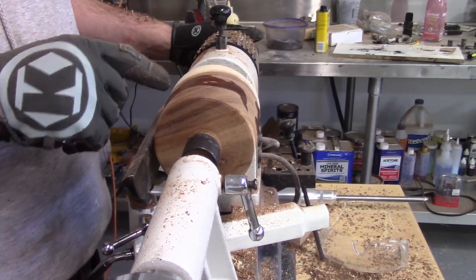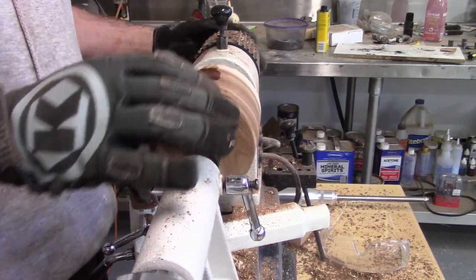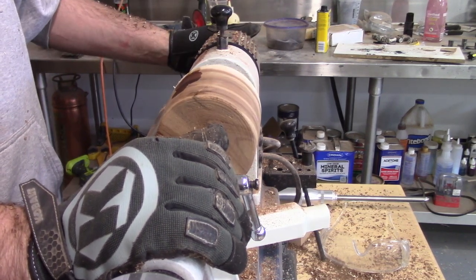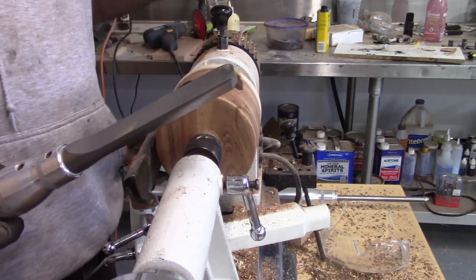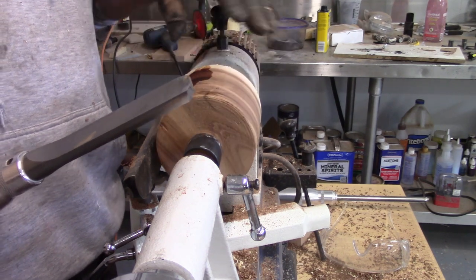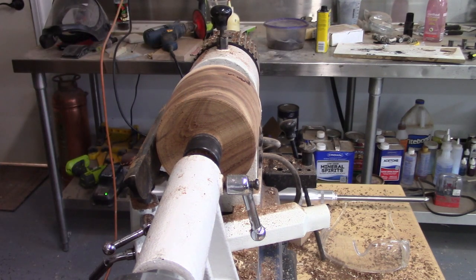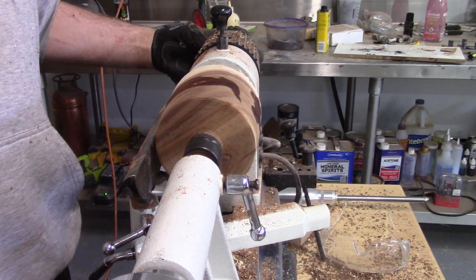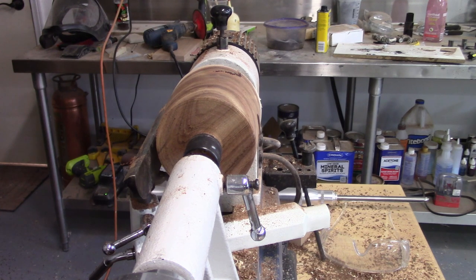I added a little bit of CA glue there just because I see some cracks in the wood, and I want to make sure they don't continue and it holds together. I'll probably have to do a little bit of filler. On the mesquite I've been using coffee grounds – old coffee grounds that I dry out. It blends and fills pretty nice, it looks like it's part of the wood. I'm going to smooth this out using my bowl scraper. I think the pattern on this wood is beautiful. I may make this a simple smooth box – let me smooth this out, then I'll sand it, hollow out this end, and make a lid.